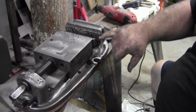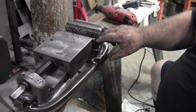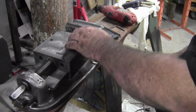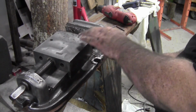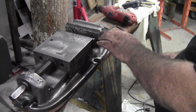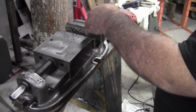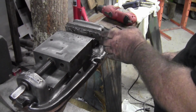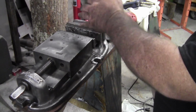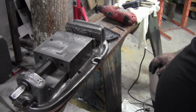I think I put them on the wrong side, but if you can tell, this one is worn away bad. It should be the same height as this. I need to replace the jaws, and that was my original intention, was to make a set of jaws for this. That's not going to be in this video. That will be in the next video that I do on any milling. We'll be making a set of jaws. I may replace this set of jaws with a new set, but as I said before, with the fact that this is canted a little bit, I doubt that this jaw is going to be reliable. It will have to be trimmed in, and I don't know if there's enough movement in the hole to reliably rely on where it's going to end up. So that's it on this vise for right now.